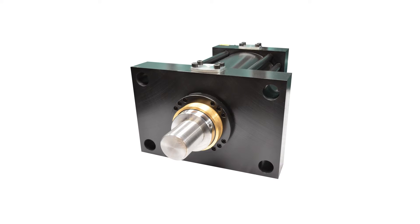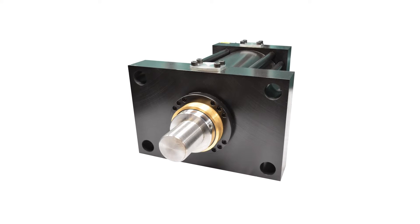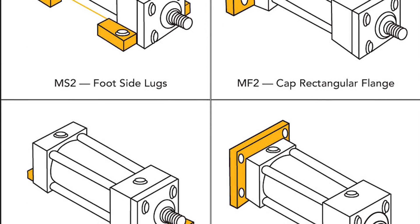Can you tell us what an NFPA or ISO cylinder is and how common they are? A lot of hydraulic cylinders are manufactured through NFPA or ISO standards. Cast tie rod cylinders and welded cylinders are used heavily on mobile equipment, but the NFPA and ISO standards for tie rod cylinders are the most common in a high-end hydraulic machine. The metric ISO standard is quite similar to the National Fluid Power Association standard using imperial units. ISO and NFPA even use the same three-character alphanumeric code for mounting options, such as MT1 for head trunnion and MP1 for fixed clevis.